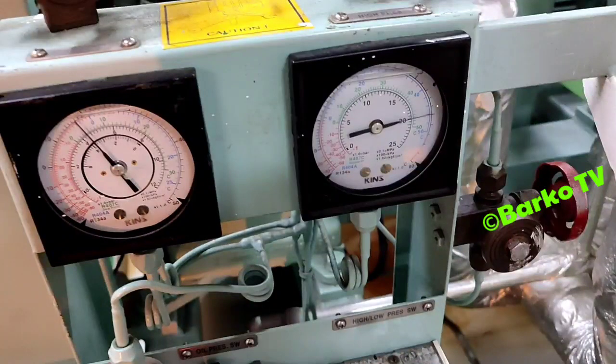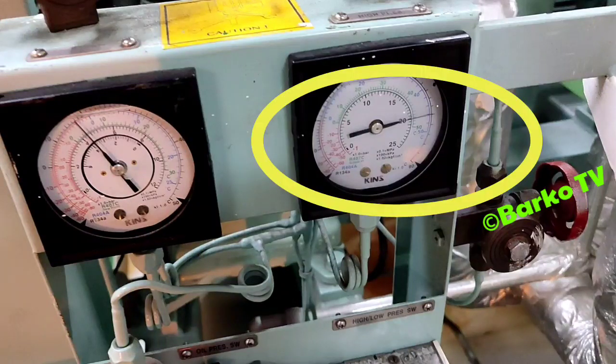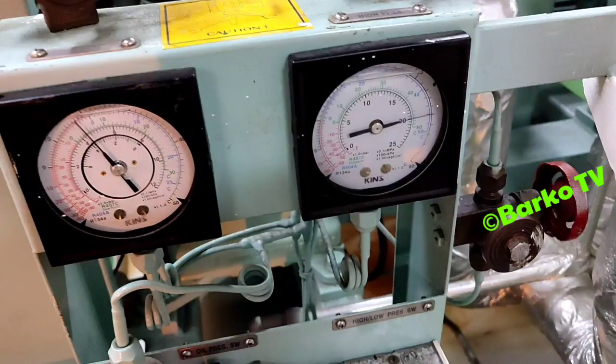The scenario is that I reset the pressure switch for the high pressure and then reset on the panel. During the restart, it automatically triggers the high pressure. As you see, it goes from 15 bars to 20 bars and shuts down the compressor. The question is why the high pressure is triggered, and we will explain why this happened.